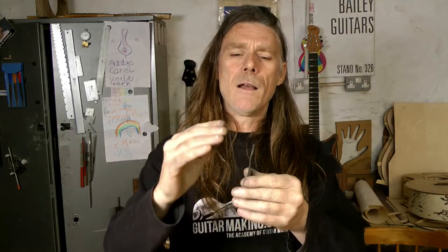Matt's asking, on the plane blade, do you use a back bevel? No. I know there is a whole lot on sharpening. But the back of my blades is just flat. Most plane blades are just flat on the back. But there is a whole lot out there. If you're interested in sharpening and you want to get into it, then, you know, go for it. But for our purposes, we just use simple standard stuff, which is flat on the back, 25 degree primary bevel, 30 degree micro bevel. That's perfectly adequate for most of our stuff.